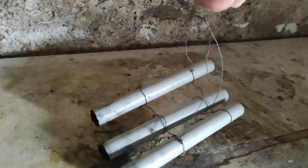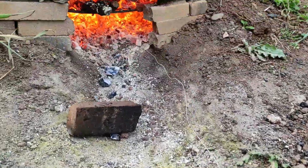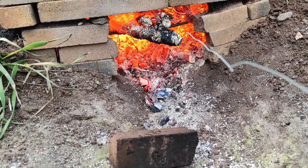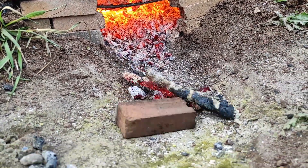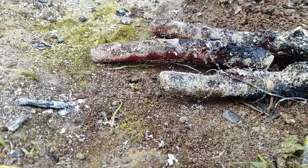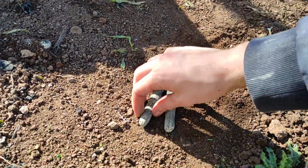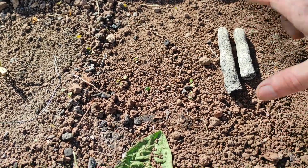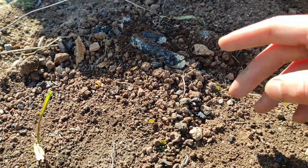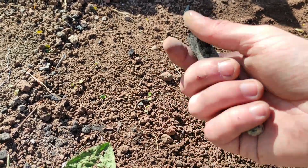I made a little support for the carbon electrodes to hang them in the fire. Let's take a look at the electrodes now. They don't seem to be too brittle and they're very hot — they didn't break. They are a bit bendy but they look not too bad. Here are the electrodes after some cooling time in the soil. I should have used a bowl to protect them from oxygen while hot, but instead I used the dirt. Anyway, they broke while cooling and are quite surprisingly not that dense — I don't really know why. I'll test different types of charcoal in the future, because I think that was the issue. The good thing though is that they are quite solid despite not weighing much, so I'm going to test them in the lab to see if I've succeeded.